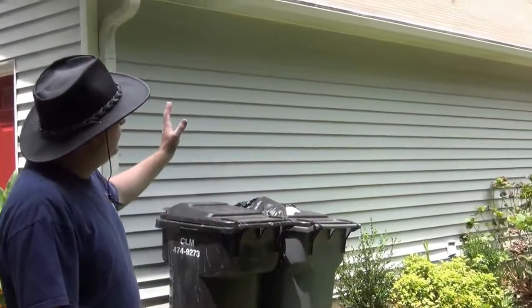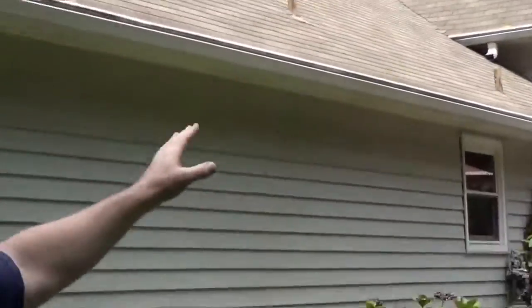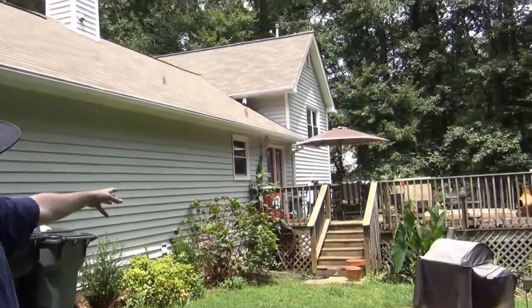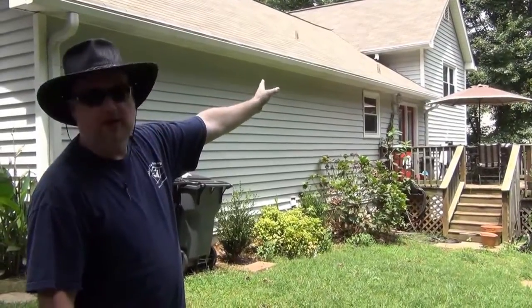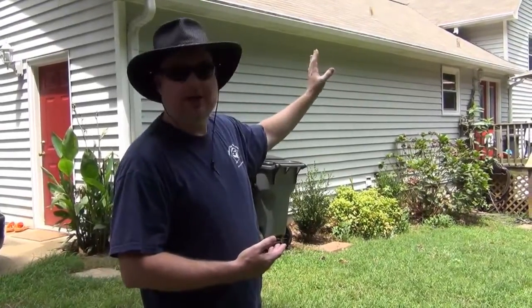Going to the back of the house, we can see the other gable vent up there. The homeowner says he's observed a few bats in that area. There's a window directly underneath it, so it's not a perfect location. But we could move a bat house over to the right and down, away from the deck and the windows underneath. I would tuck it up under the gable, to the right of that window, as high as possible. The bottom of the bat house should be at least 12 feet high — 10 at a minimum — but 12 feet or higher if possible. However, the homeowner doesn't want it on the house, so we need to keep looking.